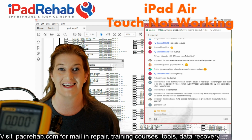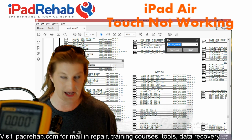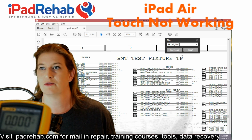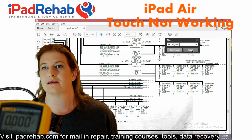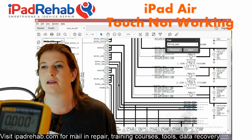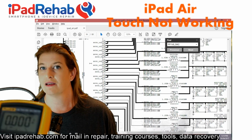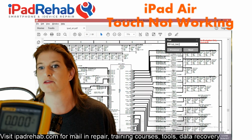All right, so let's go on our hunt now and see if we can figure out where the AKA line PP1V8SW2 comes from. So let's learn about that guy. All right, so this is just telling us info. That's where we were. Yes, okay. All right, aha. So here, PP1V8SW2 seems to be, let's follow this. PP1V8SW2 is an output of U8100. This is going to be our power management chip. So let's see, power management chip.